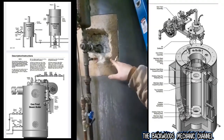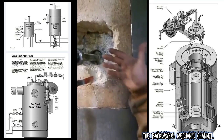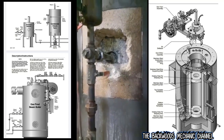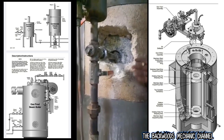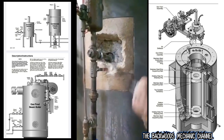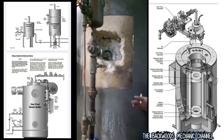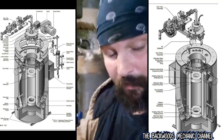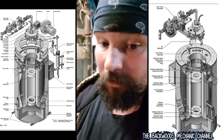Once they got to the back side, you couldn't see a hole or anything. This boiler is specifically designed with an interior shell that's pretty thick, then tubes running up and down the middle, and then a thin tin shell on the outside. If you've got a leak on one side, it's pushing steam and water - when it's boiling it can be leaking from anywhere, which makes it really hard to find. The other way to do it is take the whole shell off or start cutting sections until you find the hole, which is very expensive.